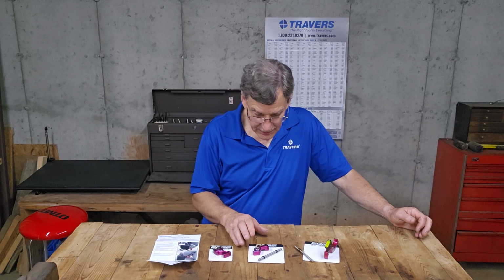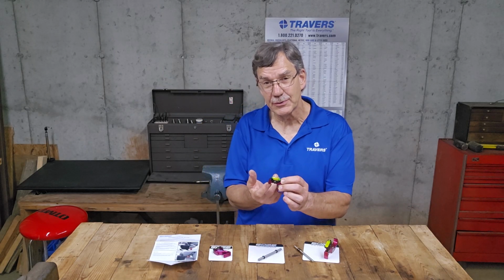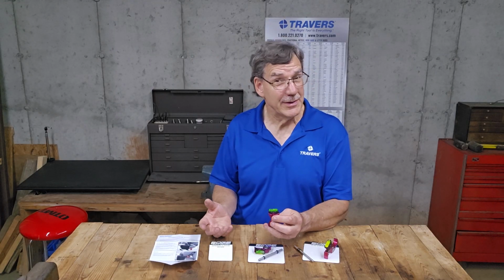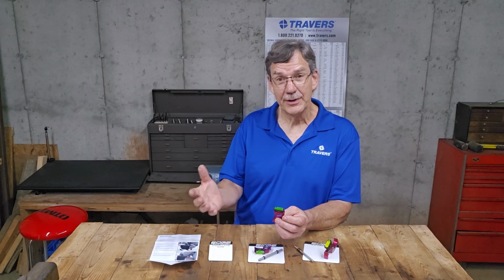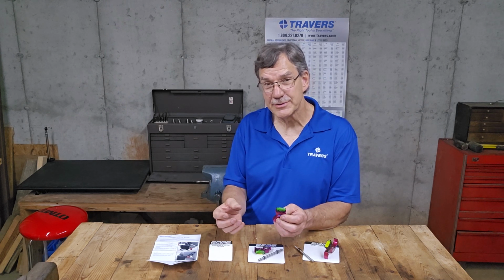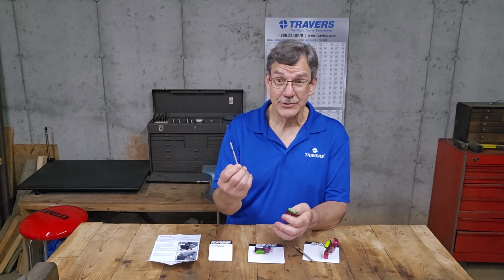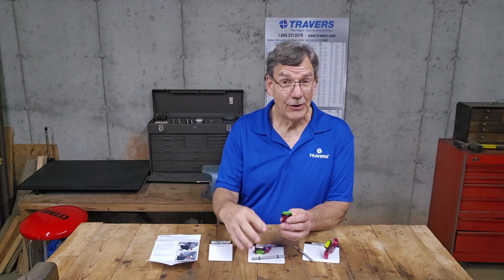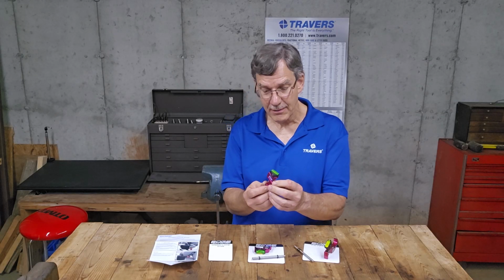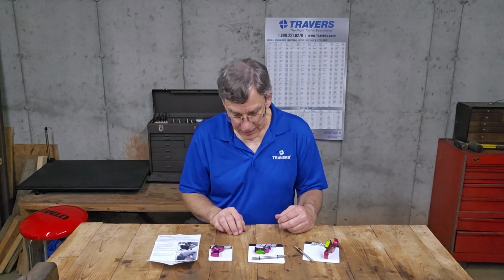For the sake of the demonstration, I kind of like the PROL lathe gauge better because it's so easily just rested right on the top of the tool. That was much easier than the Speedy lathe gauge. However, what if you've been doing some machining on your workpiece and you put a different tool in and you want to center the height of your tool and you don't want to take your workpiece out of the chuck? Maybe it won't go in exactly the same way again. You'd need to take it out of the chuck to get this little piece in there. So the solution for that is the Speedy gauge, because you hold it right up against your workpiece, as you saw, and the little lip just rests on the cutter. So I kind of like both of these.